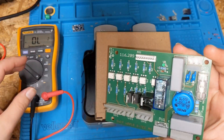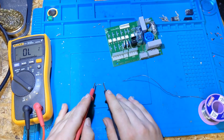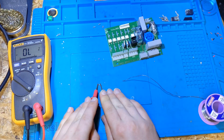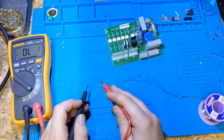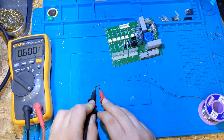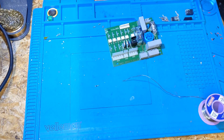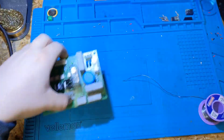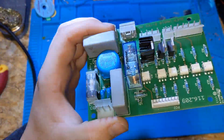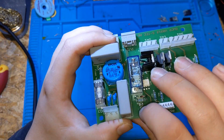I've managed to find another diode — I'll actually rob this from an old circuit board. Nothing that way, okay — 0.6 volts that way. So we'll track that onto the board like so. I've got the new diode soldered in — that's one I had to rob from another circuit, the leads are cut a bit too short, but it's good enough for testing purposes. It's got a new diode in there.